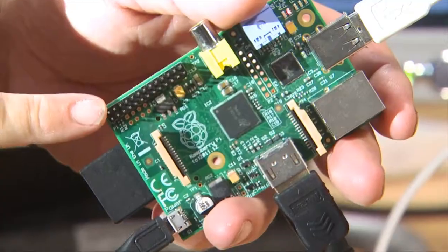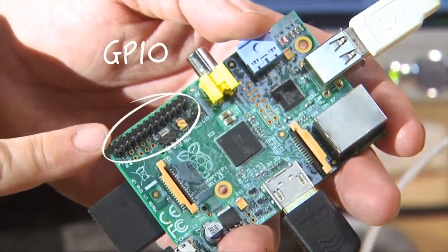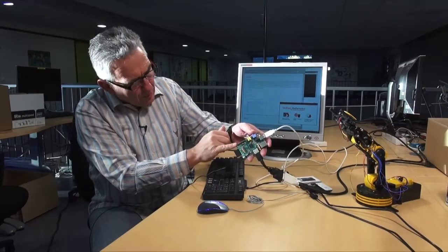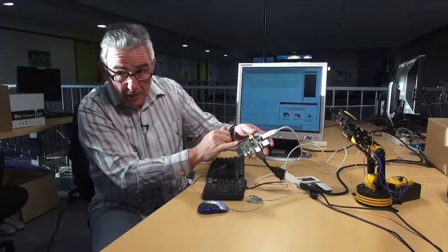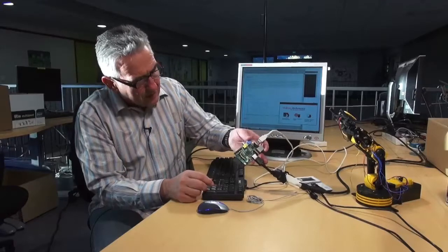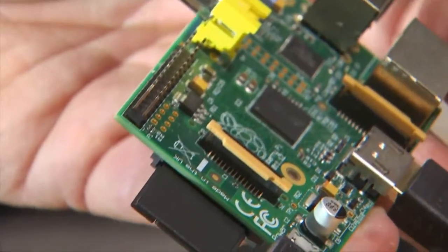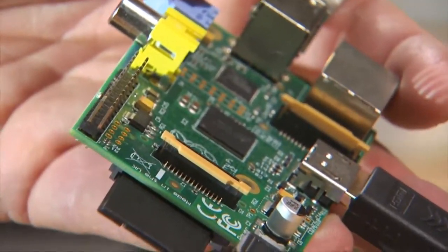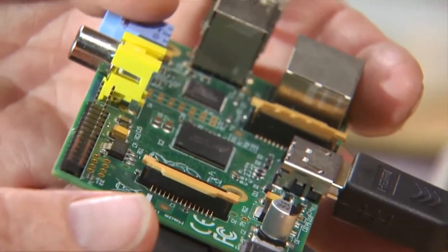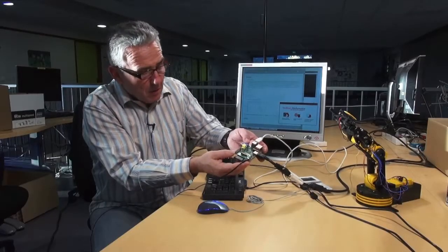I'm talking about that part, the connectors. These connectors are called GPIOs, for general ports for input and output. Those are small logical connectors, on which you can read or write signals. Through the languages, particularly Mathematica and Python, we are going to be able to read what's in these connectors and to write on these connectors. And so we will be able to connect to objects, electronic cards, to sensors. And we are going to be able to use that information and activate other objects with the calculations we've made on it.